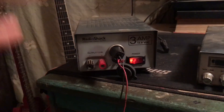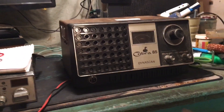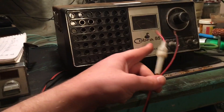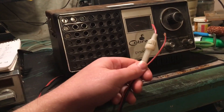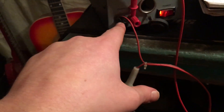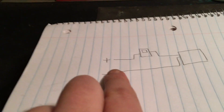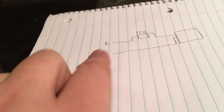I'm going to show you how to figure out what kind of power supply you need, just in case you haven't got the information already. We're going to use this Cobra 85 that I've wired to be usable on DC. This is actually a base station radio so it does have a power supply inside, but we are using it with DC so I can show you how to measure with a multimeter what amperage you're pulling. We have one side of the multimeter hooked to the red terminal, the other side to the other side, and the black is run straight to the power supply. All it is is we're running the multimeter on one rail — from the power supply through the multimeter to the radio.